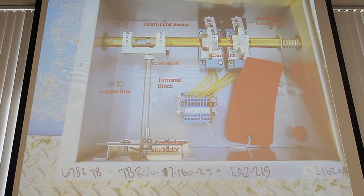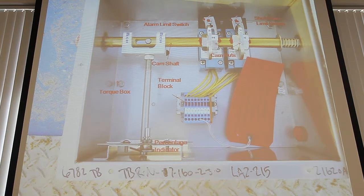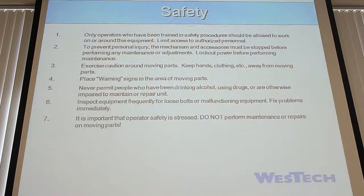Correct. Yeah, correct. I mean, there is a grease zert right underneath for the cyclo. That's right there. That gets grease in that top part of the cyclo. So, you want to be careful if you're pumping grease in there. But usually, turn it off for a few minutes, pop that in there, and grease it. The cyclo has a sealed housing, so you shouldn't have to really be greasing it a whole ton, but especially as it gets older, it can require more and more.